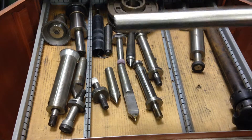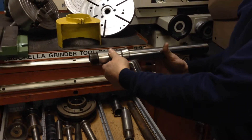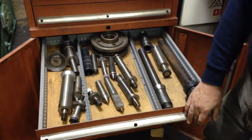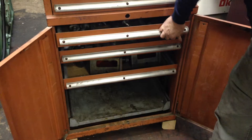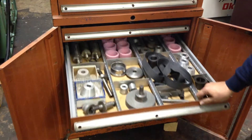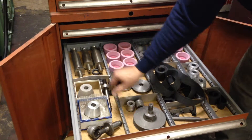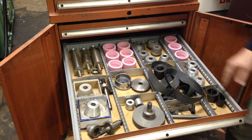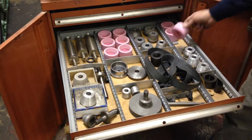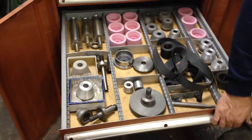This is a precision ground tramming bar. What you do is put this in your headstock and you can indicate that headstock to dead zero — it's also useful for some other applications. The cabinet does come with the machine. We have more arbors in different sizes — some small short ones and some stubby ones. A few cupped diamond wheels, various sizes. These are some stone wheels that go with the machine, and these are different size arbors that go with the machine.